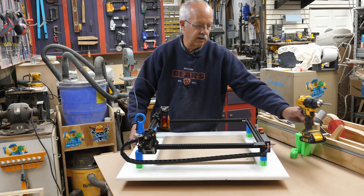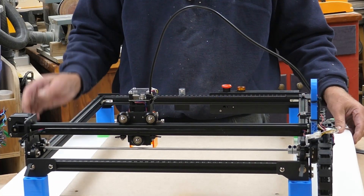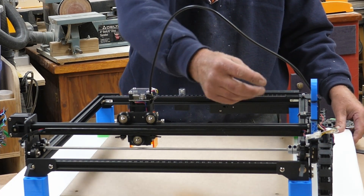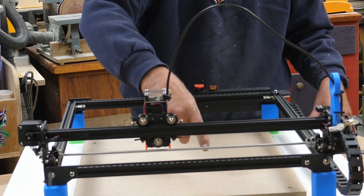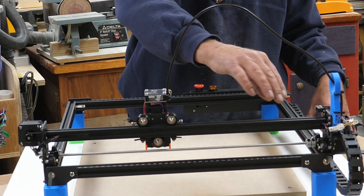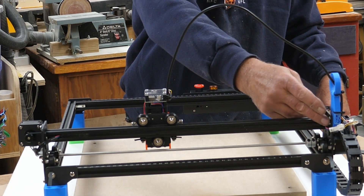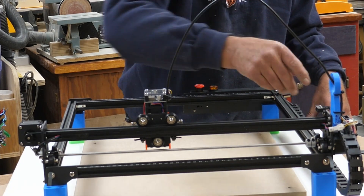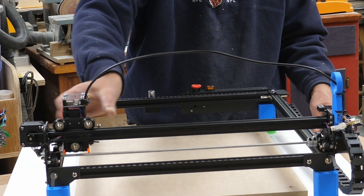You're probably wondering what this guy is. I didn't really like the way the cable was fastened according to the factory recommendations — just tie-wrapping it to that little spacer post — because I could see it could flop down and get into your work. This bracket is also from Thingiverse, though I don't remember exactly which one and I'll put the link in the description if I still have it. It wasn't designed for this laser, so I modified it and re-drilled some holes, using 3mm socket cap screws and nuts to hold it in place. I passed the laser wire through the loop and threw a tie wrap on it to keep it taut. I've played with it and I don't have that flopping issue anymore, and it does not interfere with full travel.